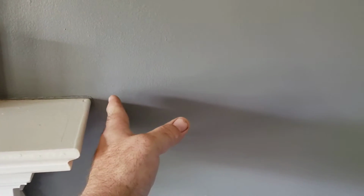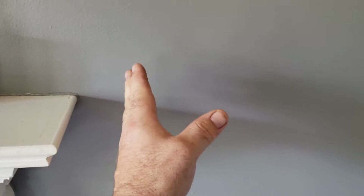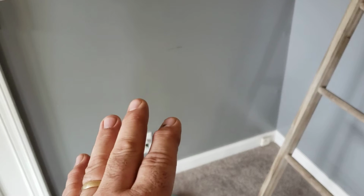One is actually coming about 42 inches, which is going to be about 2 inches off of the edge of this and building up and over to the right. Upper section on the right hand side would be a hutch with adjustable shelves, 12 inches to depth, maybe 18 inches to depth. The base on the bottom will be full height doors, a base 42, at least a 1-inch filler on the right hand wall. And we're going to be moving this electrical outlet up to the same height as this switch on this side. That way it's above the counter space.